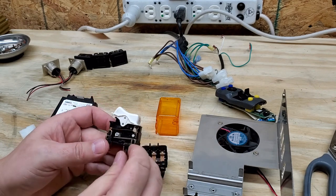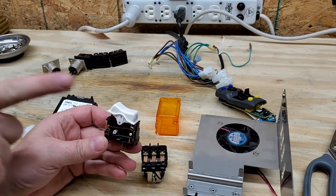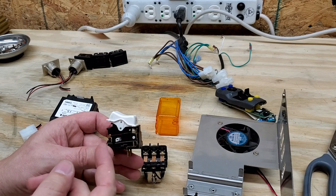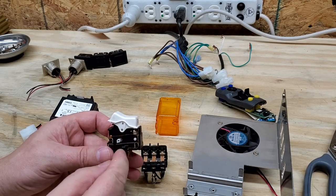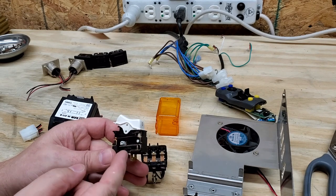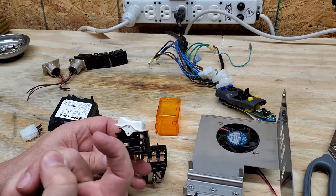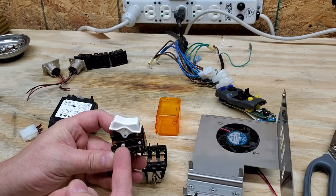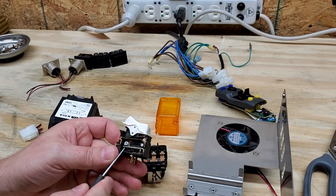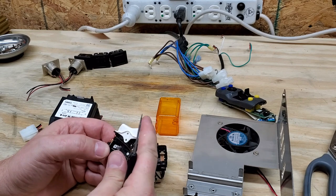So that's on. When it's on, there is this bi-metallic strip right here — it goes this way and then it goes that way. What this little bi-metallic does is it's basically a resistor, as all metals are, but the more current that you throw through that resistor the warmer it's going to get. When this particular metal gets warm it deforms and it actually curves and tends to pull up. When it gets warm from current it springs upwards like this, hits this lever, and you can see that's what happens — it shuts the power off.